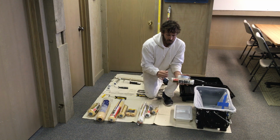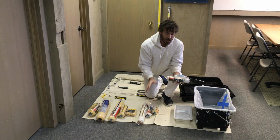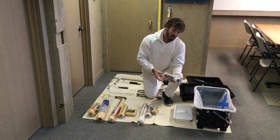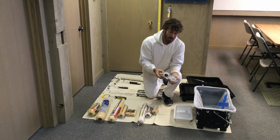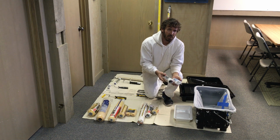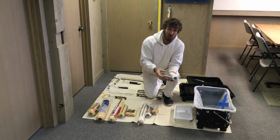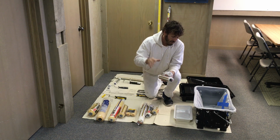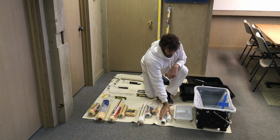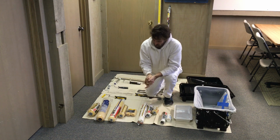These again are woven covers. They're white. They're a better quality cover, just like your wall covers, because these we're going to use on doors. These are 1/4 inch thick or 3/16 inch thick, depending on the company. They're very hard to distinguish. They're very, very thin, which means it leaves a lot smoother surface on your door. So we use these on all doors, selective trim if it's flat trim and it doesn't have angles or bevels in it. And that's just an overview of our roller pans, roller liners, roller covers.